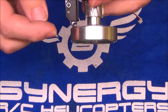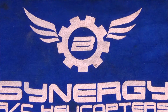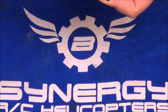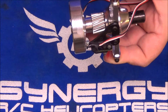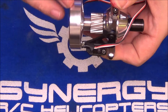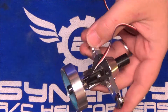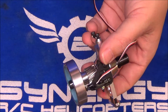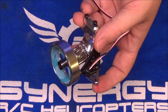This is going to be kind of hard to see in the video, but I've got this gap of probably about a millimeter. The Align RPM sensor is pretty sensitive — ICON puts out plenty of power for it, so you don't need it to be paper thin. Once I get this on the helicopter and get the flybarless unit on and in a position where I can test the magnetic read, I can adjust that if I need to. Getting to this sensor to maintain or adjust it while it's mounted in the helicopter couldn't be any easier. There's just nothing in the way.